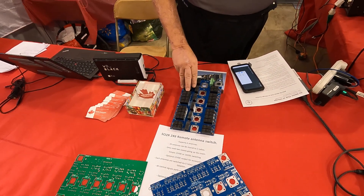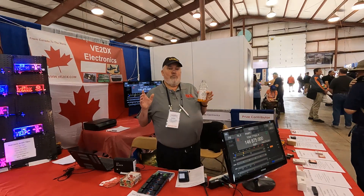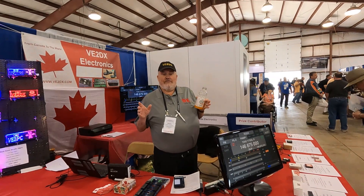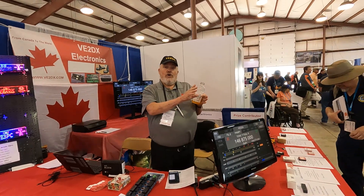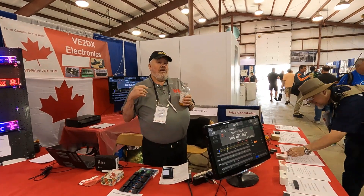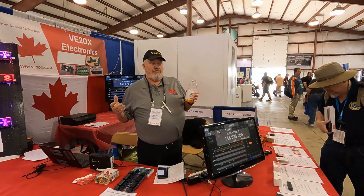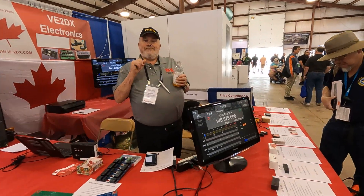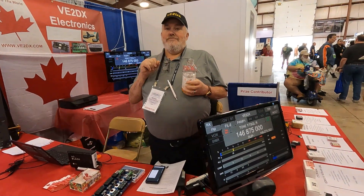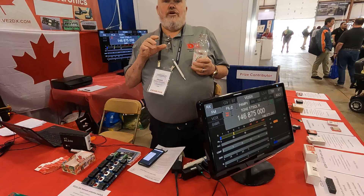We have in the works two new products for 2024. One of them is going to be a CI5 hub where you will be able to create a routing table. With that routing table, you will be able to resolve issues like with the PW1, where a port is only talking from a specific radio — say a 9700 — to a separate port. You can use two ports for two radios and mix and match by working on your table translation. So if I have two 7300s, one on 40 and another on 20 meters, doing SO2R contest stuff, you'll be able to put programmable logic to make sure they don't clash, don't transmit into each other, choose the appropriate antennas, and will not hear one another.